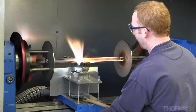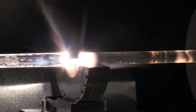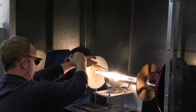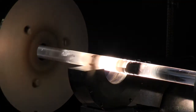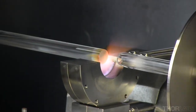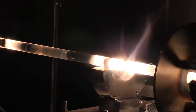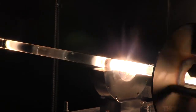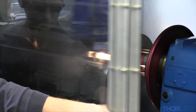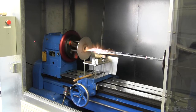Eye protection is required to shield the engineer's eyes from the brightness of the torch. Once both handles are attached, they are mounted, or chucked, into a lathe, suspending the preform over the water-cooled half moon burner. As the lathe rotates the preform, the burner slowly passes along its length, removing all surface contaminants. This process is called fire polishing.